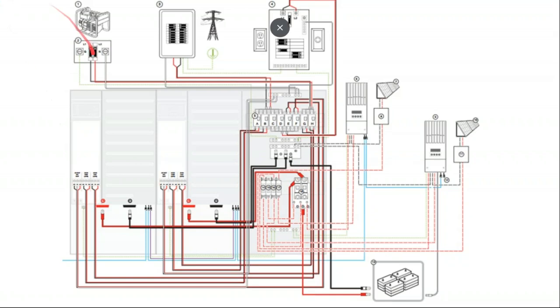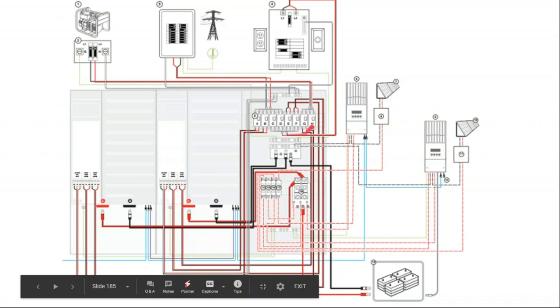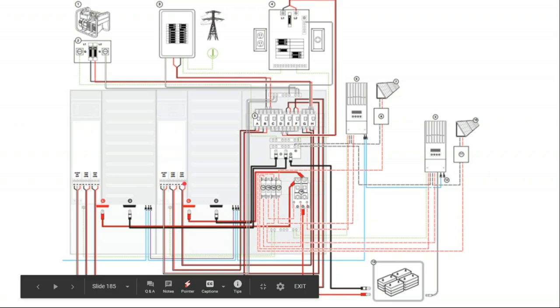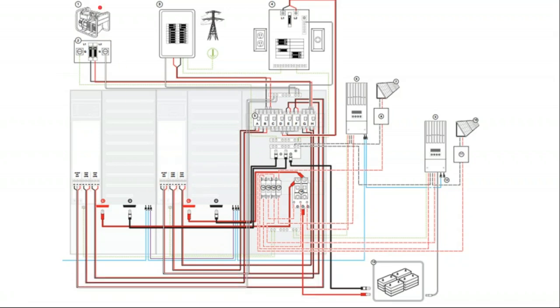We got the single generator connection being wired across two breakers that then go land on each inverter. So these are like 7 kilowatt inverters. This could be a 15 kilowatt generator, and it divides the power between the two inverters. And so we don't have to worry about our inverter terminals being fed with too much power from the generator, passing through all that power and burning up. If we had a large generator and a small inverter, and that generator power is being fed into the inverter, the terminal blocks might not be rated for that current.